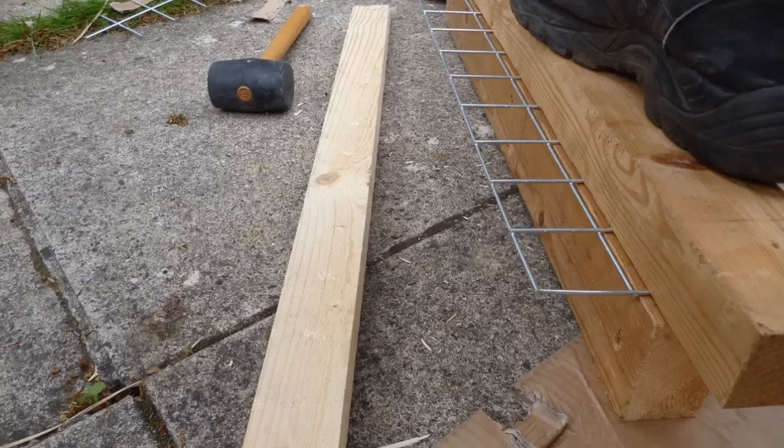Once the piece was cut into shape we then had to bend it down. We achieved this by sandwiching it between two pieces of wood and then smacking it with a hammer - nothing more cunning than that. The mesh we used was 2 inch by 2 inch, which meant that if you position it on planed 2x1 wood, that makes it quite a suitable former size for the bends that you want to make.